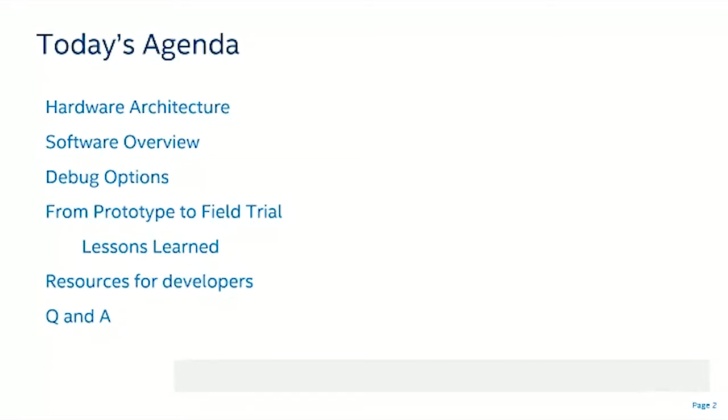For anyone joining late, I'll read the abstract. Connecting wired sensors to an IoT gateway may not always be the best choice. Today we'll deep dive into implementation of an untethered solar power monitoring system, learn how to add wireless sensors using an MQTT broker as an intermediary, import sensor data into Node-RED on an Intel gateway, display them locally or publish to the cloud, and use Android apps to help debug the PubSub process.